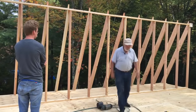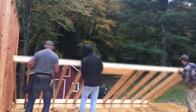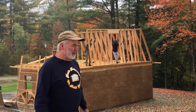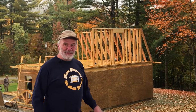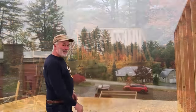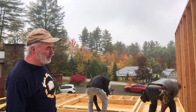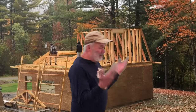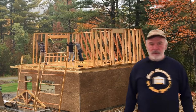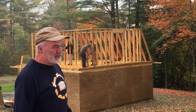We nail off the tops and that side is done and ready for plywood. More walls go up, including the gable end wall on the back — those are pretty heavy to pull up from down on the trailer; we had to muscle it around quite a bit. Once they're up and braced off, we decided to sheath from the outside, which was just easier.